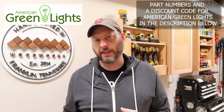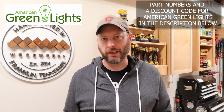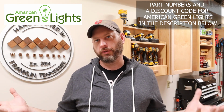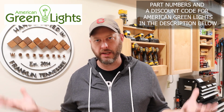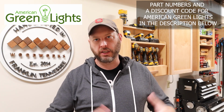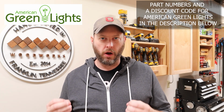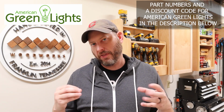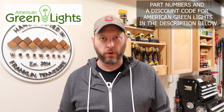What the retrofit kit allows you to do is take an existing light fixture. Again, I had already made the investment in 12 light fixtures in my shop, and I didn't necessarily want to just give that up and reinvest in completely new fixtures. All I really had to do was purchase the actual LED light strips and the power driver to deliver the power to them. And the process for converting my old fixtures over to LED using the retrofit kit is what I'm about to show you.